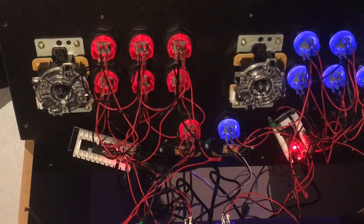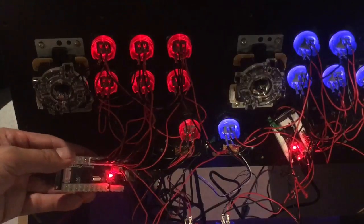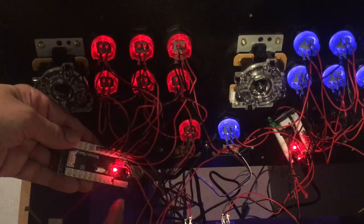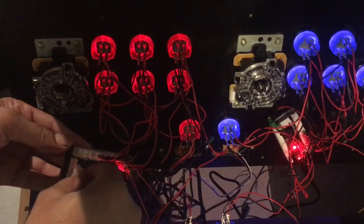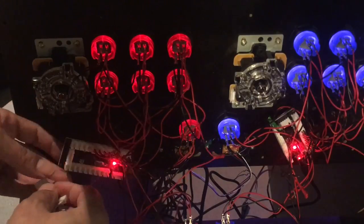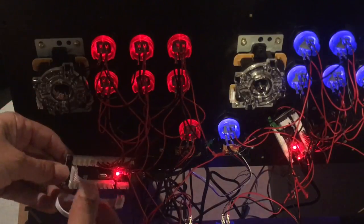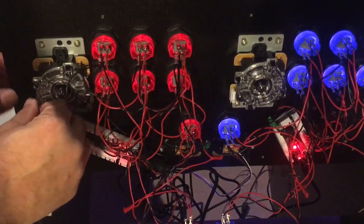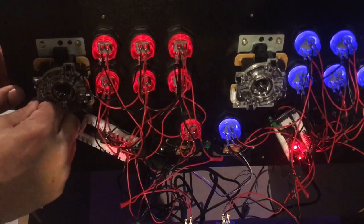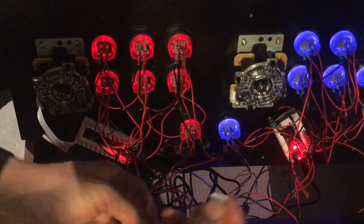And a lot of people make this mistake. When you're plugging into this thing here, they'll plug this cable into this end here, and that's the wrong end. When that happens, it'll be similar to those wires touching, the things that keep blinking off and on. Whenever you push a button or something, it'll just blink. So you have to make sure you're putting this on the bottom.